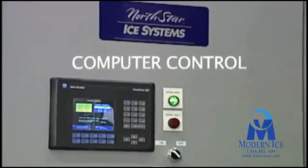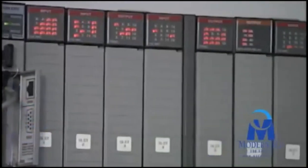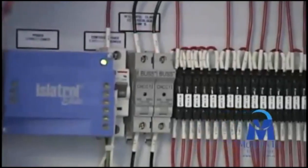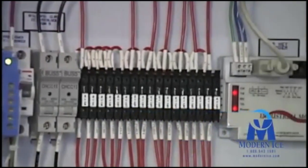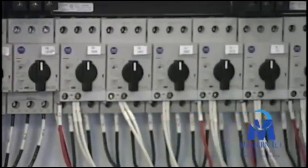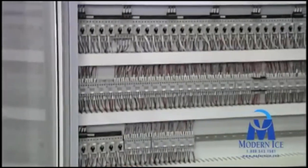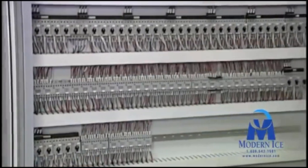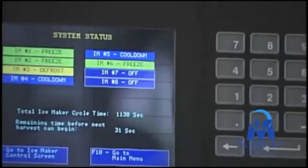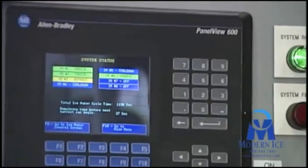The entire plant is controlled by a central control panel with a micro relay system. Sensors are located throughout the plant, detecting everything from high ice, low ice, non-functioning equipment, and hoppers that are too full. These sensors are constantly monitored by the central control panel, which starts and stops equipment as needed. A good example would include a sensor on the rake that will call for ice when low, and send the signal to the ice machines to stop when full.